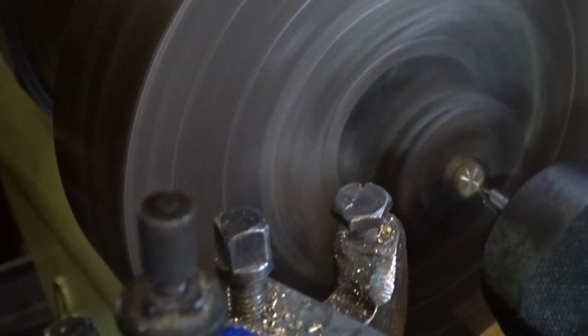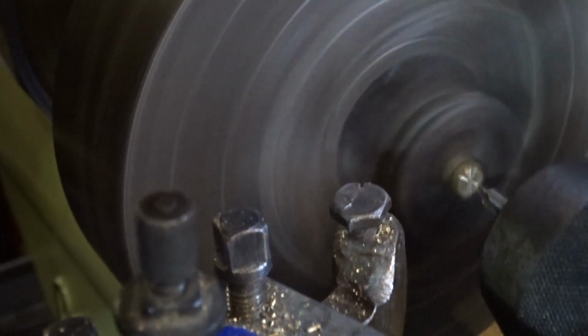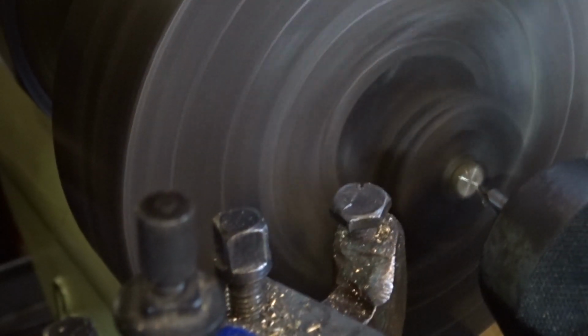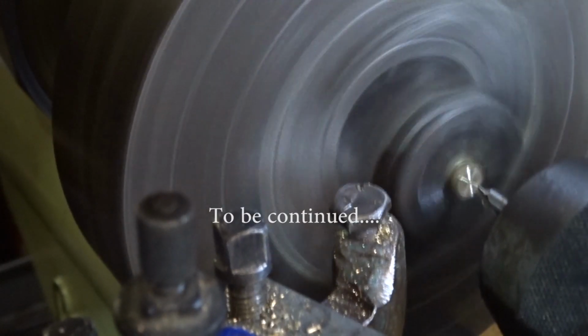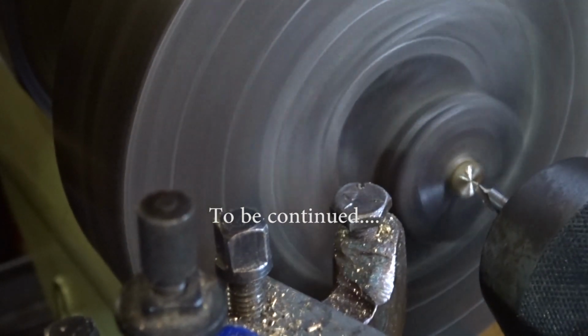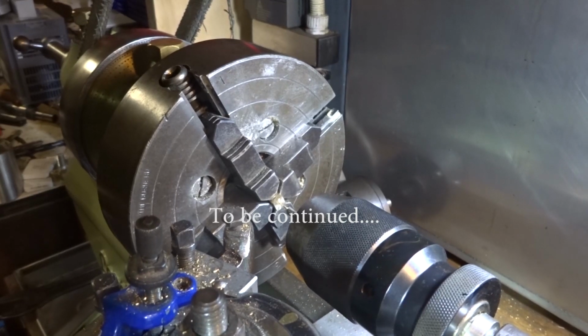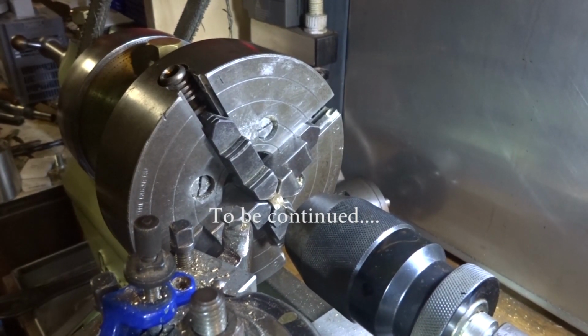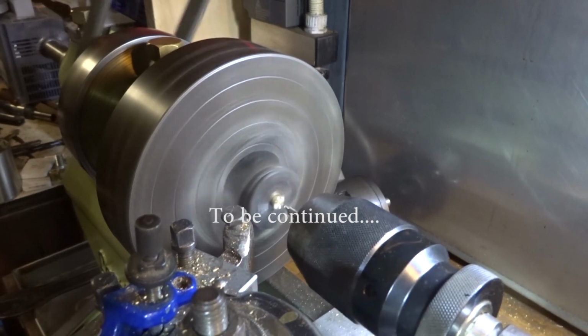And length's not particularly critical. If you're within about a millimetre, that's going to be good enough. If you're making 3 of these things and they've got to line up beside each other in a competition and look like they're all the same, that's nice. Or if you're copying a prototype, then you would be a bit more careful with things like this. But we're only making 1 of them. So, nice sharp spot drill or centre drill.